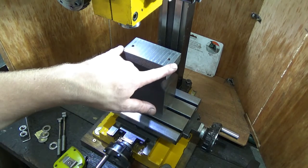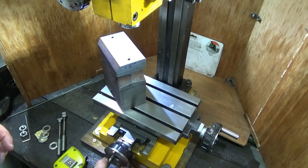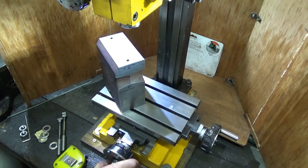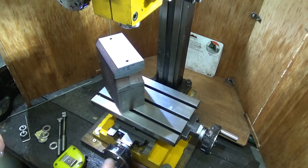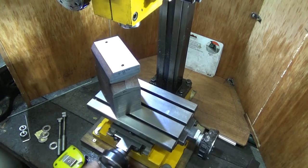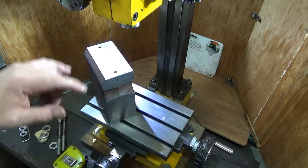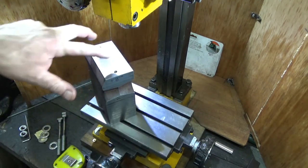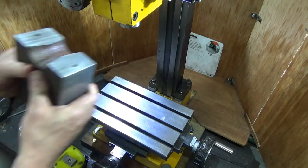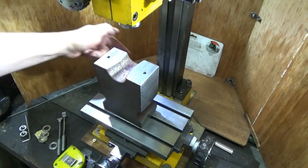Now this is just wide enough to be able to clamp the column to it, and the first bit of this give is really tight. Very rarely use that bit of travel because it's hard to use, although I do use it. So I think you can now see the bottom of the column coming. Yeah, you can see the hole at the bottom of the column. So those four bolts there have got to go, and I've got to draw a hole pattern in the top here. Not there. I've got to draw a hole pattern in there to accept that.